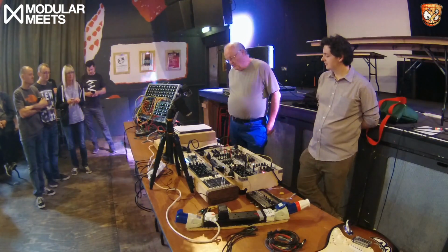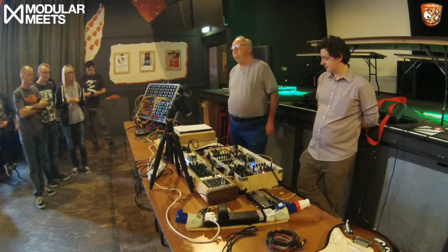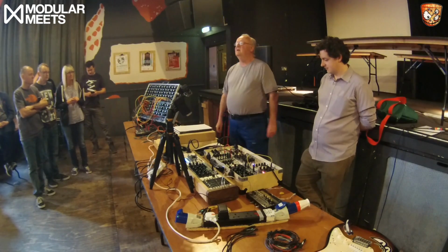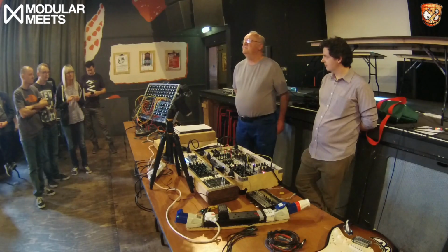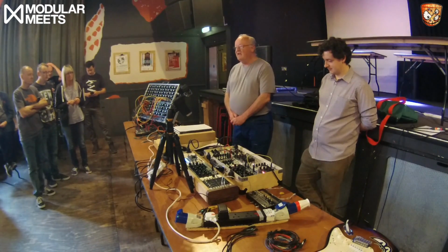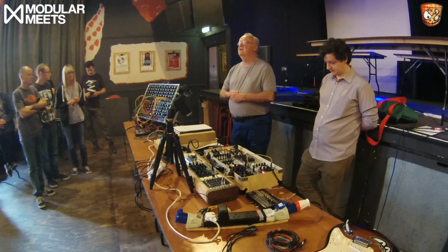And if you just take the original LFO out of the classic Gristleizer, it's not very exciting. It's just a standard synth sort of thing with 4 waveforms, and it was great for 1973, but it's not that exciting now. So we need to do better than that. It'd be nice to have voltage control morphing between waveforms. That was an early requirement.